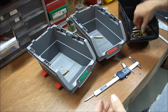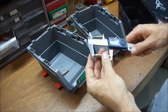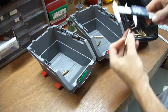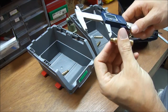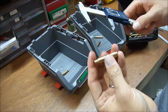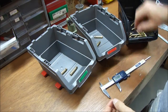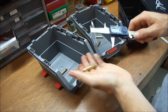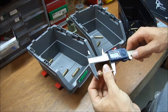We just continue looking for go, no-go. This one's too long — needs to be trimmed. No crimp on that one. Really look the necks over closely — that's where you can start to see little splits and stress fractures. Also look at the head. Just be really vigilant. This is less forgiving than pistol, that's for sure. So that's the general idea for this stage: inspection and measuring to see if they need to be trimmed.